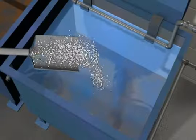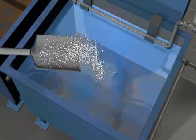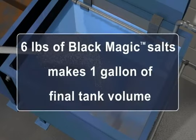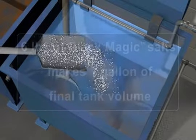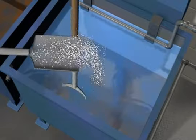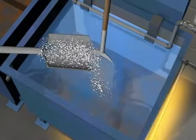Always add salts or powder to water. Never add water to dry salts, as they will overheat and stick together in one large mass. Each 6 pounds of Blackmagic salts dissolves to make one gallon of final tank volume. Stir in salts with a paddle or mixer, as undissolved salts cause hot spots. When the correct amount of black oxide salts have been added to the tank, then turn on the heat.